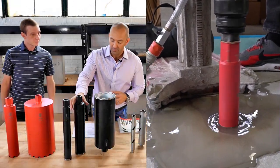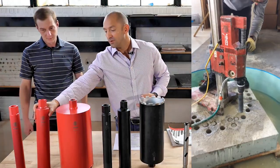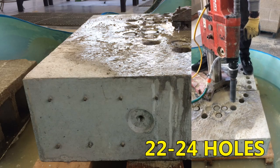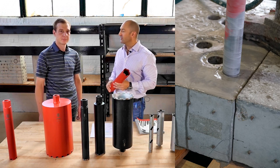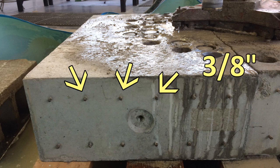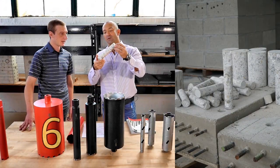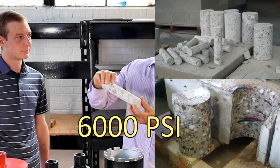We tested a two-inch core — we tested both the red ones and the black ones. We made as many holes as possible. We had those slabs over there — eight-inch concrete slabs with some rebar. It was three-eighths remesh in there, and it was rock aggregate too. Six thousand PSI with rock aggregate with three-eighths remesh. You can see the little pieces too.